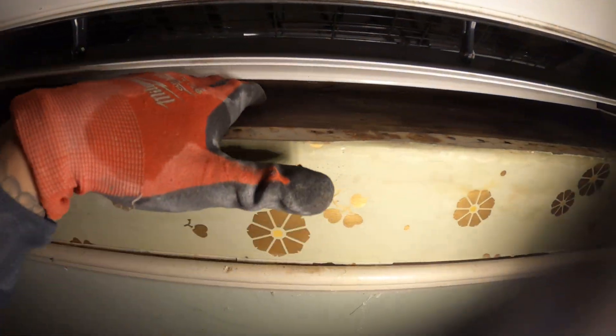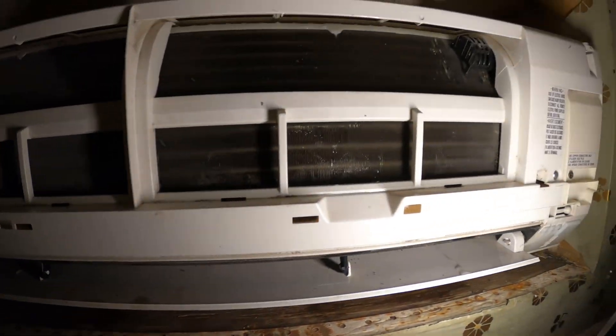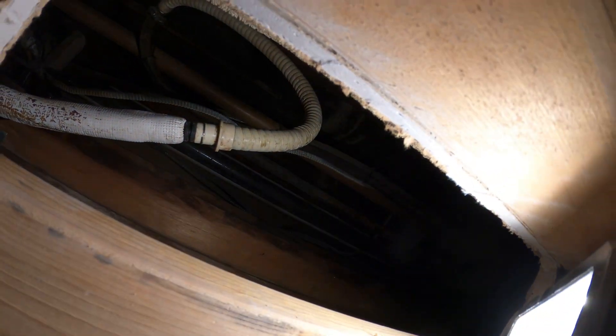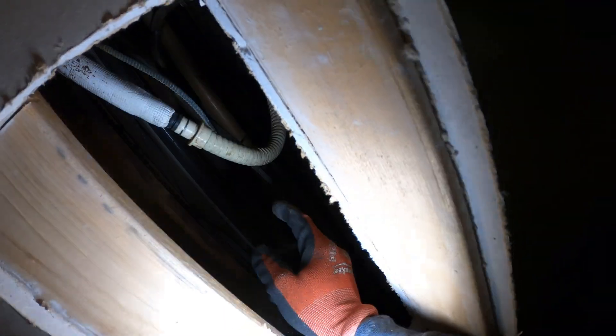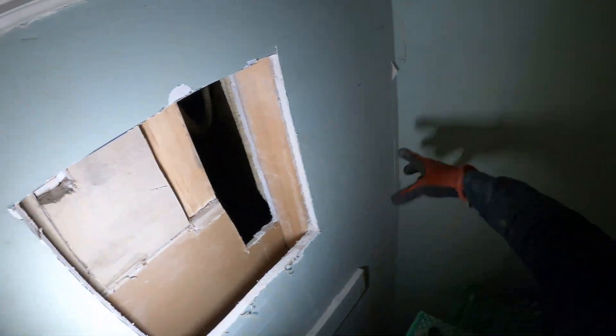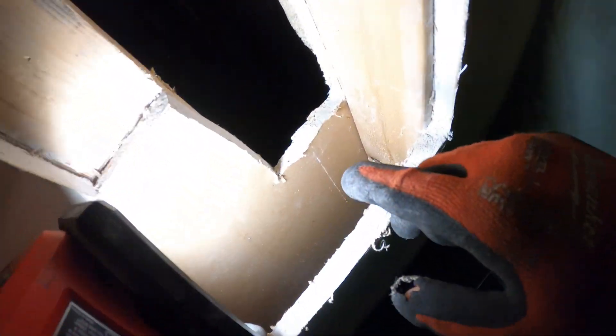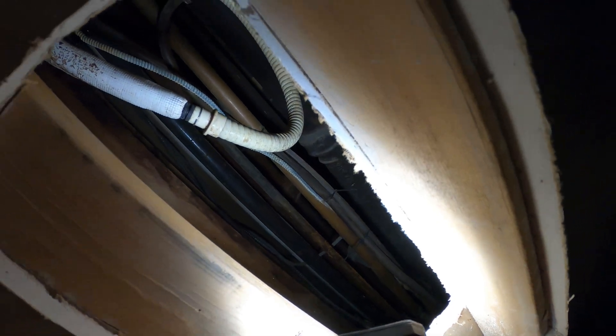This thing is like warped — I don't know why it just doesn't go on there right anymore, but regardless there was no water coming out of there. Whatever little drip might be here is from me pouring down the water bottle. I don't see anything leaking — and I just don't see how we can fill up this tiny little pan with six bottles of water and not overflow. So I'm going to say we're good. The only thing that bothers me is this possible trap issue. If this becomes an issue, I would have to cut open this wall and run a hose straight down — because I'm not feeling that trap right now, but it seems to be working.